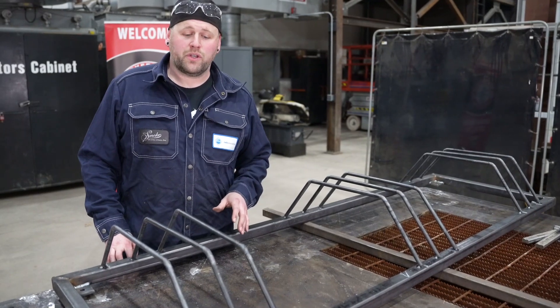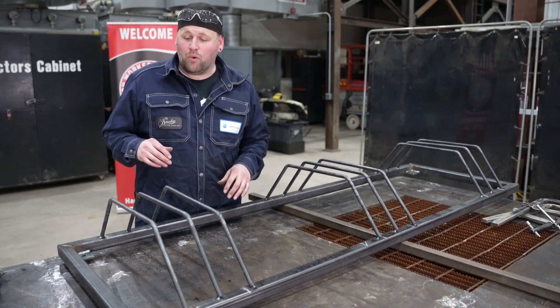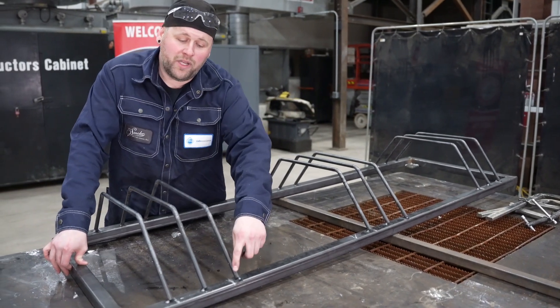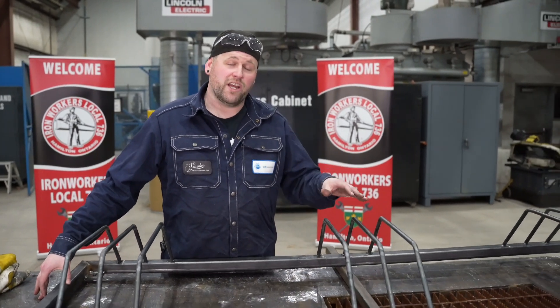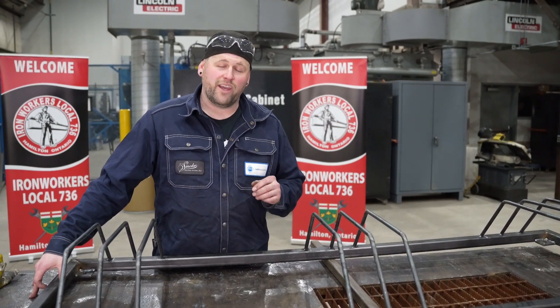No matter what material you use, you can expect the welding to create stress in it. Since all of the weld is on one side of this, it's going to want to banana. What I'll do is tack this end with a shim in and clamp that far end to create a back-bow, then come in and weld all of these — hopefully mitigating that warp. Just a little side note: the amount of pre-stress you use comes with experience. This is my estimation of what I should need — it's not an inch and a quarter over the six feet, but that could change. In the end, as long as it's pretty straight, you're lagging it down to concrete and that will finish the rest.